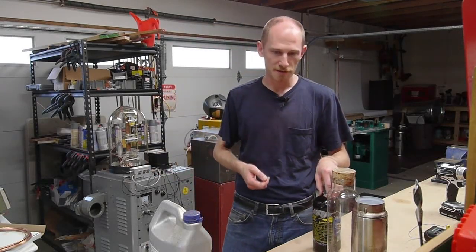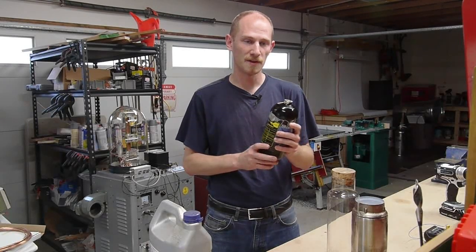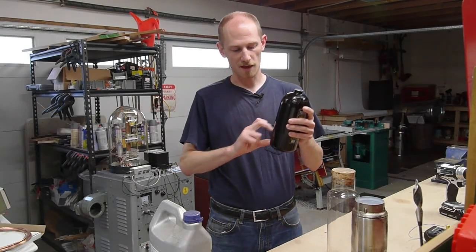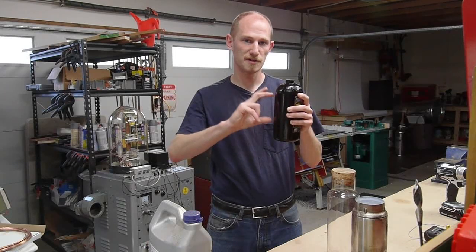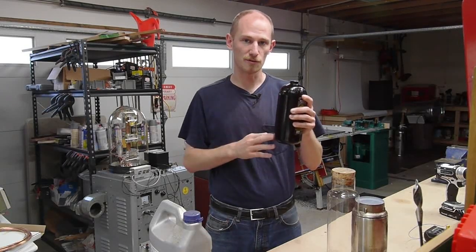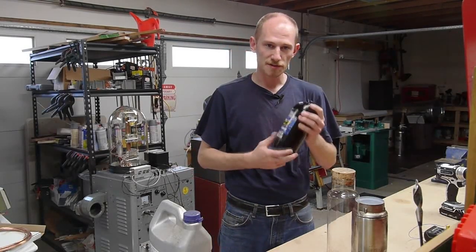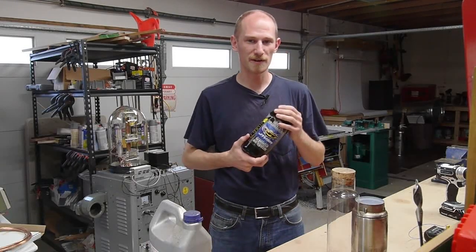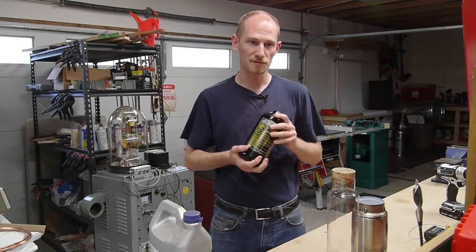I think I'll follow up by trying something else. Maybe I'll convert this chamber to be more of a proper vessel where I can put more solvent in the bottom. A lot of commercial supercritical CO2 decaffeination works by having water and ethanol at the bottom of the chamber with the beans suspended above in a mesh net, and the supercritical CO2 passes through the beans and through the water, transferring the caffeine into the water. Maybe I'll try something like that. Also, someone sent me information about aerogels, so if I cut this chamber up to access the whole inside, that might be something fun to try too.